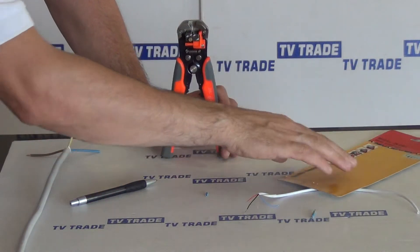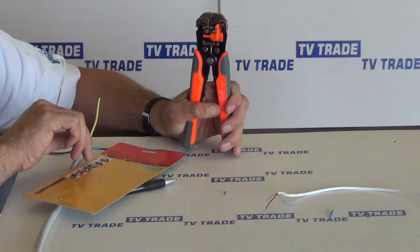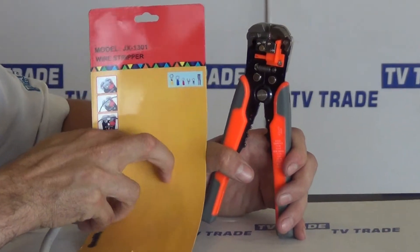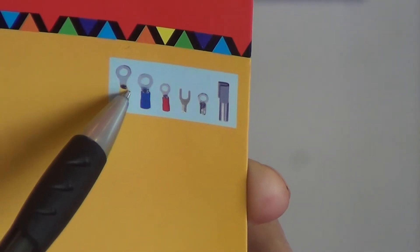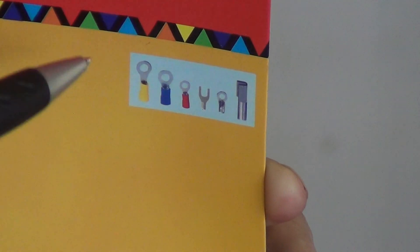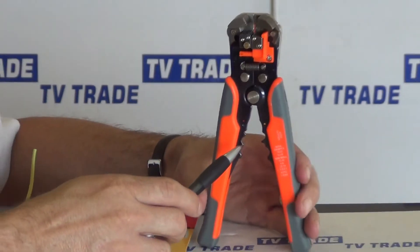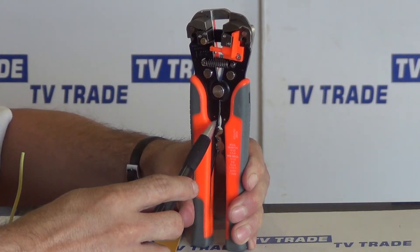Now the third part — I can talk about it, though I can't fully demonstrate because I don't have the lugs to put on the end of the cable. But imagine the scenario where we're trying to compress on a connector. I'm going to hold up this display card beside it. We can see different types of connectors here. If you have a cable you want to wire in, you could wrap it around a screw, but a far more effective way is to crimp this lug onto the end of the cable and then screw it directly onto whatever terminal you're connecting to. The larger connectors are colored yellow, then blue, then red. Looking at the crimping mechanism itself, you can see it has matching color codes — red, yellow, and blue — so you know exactly where to place each connector and don't apply too much pressure.